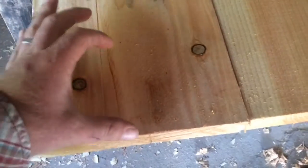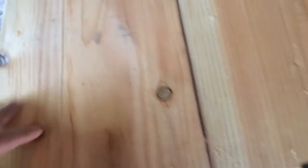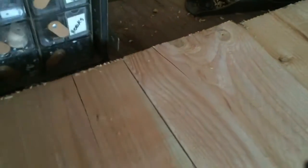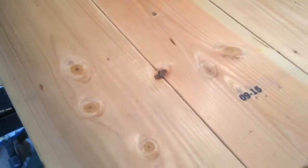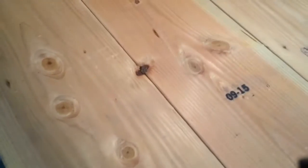The other thing I want to consider is that I don't want to have any knots in the first couple of inches of my boards, because I'm going to be cutting tenons in the ends of my boards. Here's an example up here. I've already fairly well got it laid out. One thing I found funny — this is entirely coincidental — these two boards, they're not even the same color and they didn't come from the same spot, but at the same place on each board the grain actually matches up. The knot patterns don't even match as though it was split from the same spot.